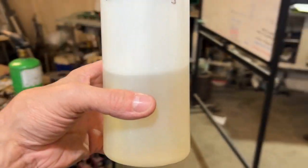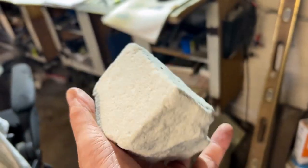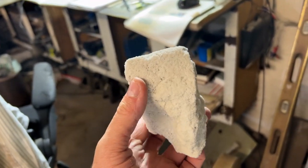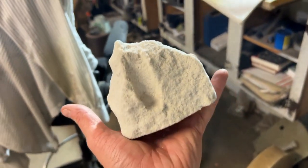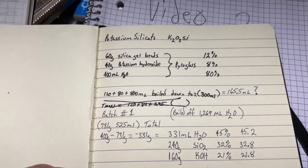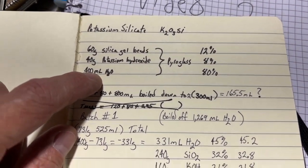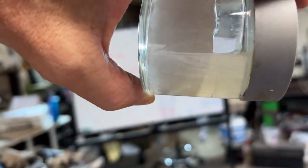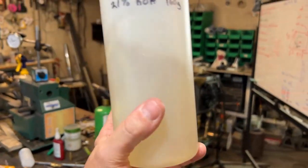You can use this stuff for casting — here are some sand molds I made a while back. This stuff is extremely tough. You mix it at three percent by weight, just enough to make sand castles out of it basically — that's how the consistency should feel. It can be cured with CO2 or just air-dry. To make that batch I essentially just repeated this twice. If you don't use this much water, it won't boil down and won't absorb all the material. If you boil it past the point I showed you, you can't store it. This ratio will keep indefinitely.